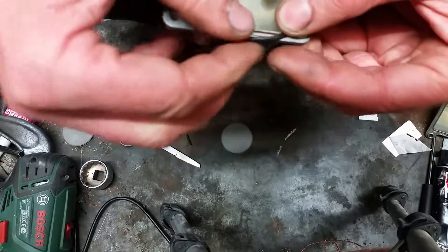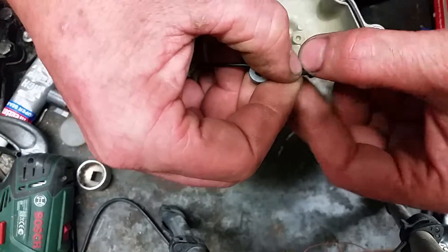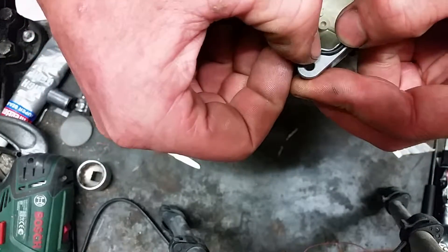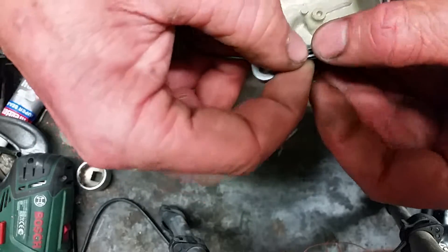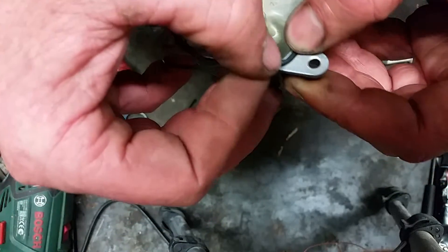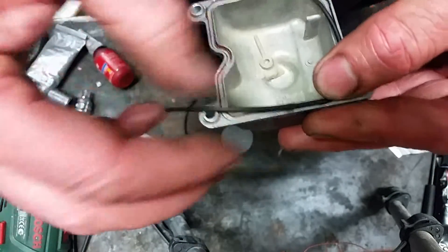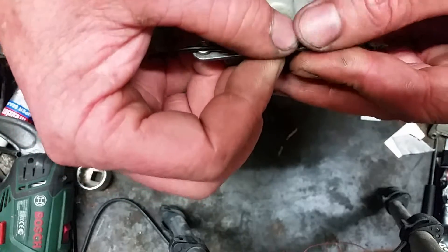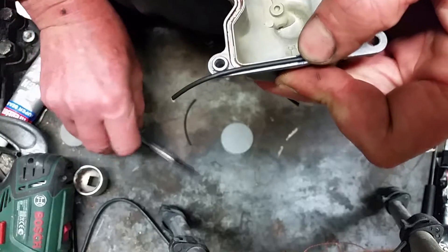It's important not to stretch the o-ring or compress it — it needs to fit in there nicely and just naturally lay in there. Obviously when joining the o-ring together to install it, I'll put some grease in the groove to hold it in there. All right, that's about how long we want it.